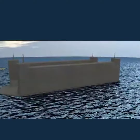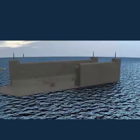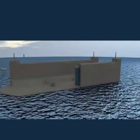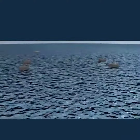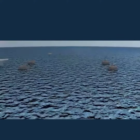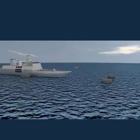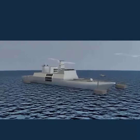The basic concept of this floating dry dock is that valves are opened which allow the two side tanks to fill up with water. This extra weight of the water will cause the deck to sink below the water line. It's a controlled operation so that only a predetermined volume of water is allowed into the tanks to reach a certain depth below the water line. This continual filling causes the deck to sink to that distance.